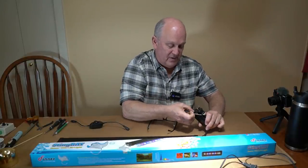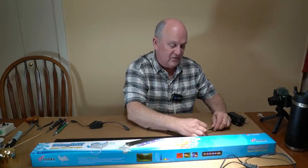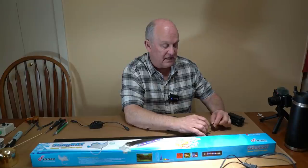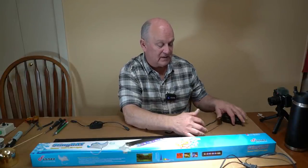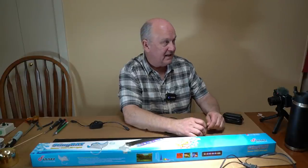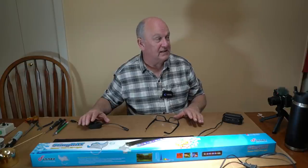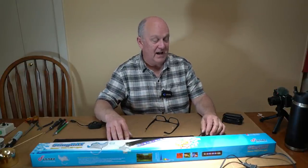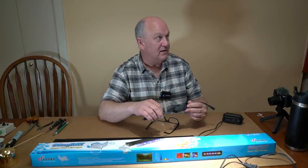What we're going to do is attack this light here. One of the things you need to notice on the cord is you've got a rib side and a smooth side on the cord itself — you'll see the ribs. All lamp cord, which is what this is called, has that. And when we're going through this whole process, you have to keep the rib side and the smooth side in the same orientation as you're coming through this dimmer.